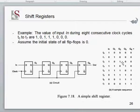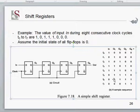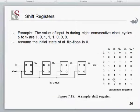And then this whole thing is clocked through. And what you can see is every time this whole number is shifted up by one bit after every clock edge because of this whole sample and present at the output effect, that all happens synchronously. Synchronous just means at the same time. They're using the same clock. All right, so you have this effect where this shift register is just remembering 4 bits of information, and the way that we input data into the shift register is through a serial method, and the way that we output it is also serially. Serially just means on the same line at different steps of time or different stages of the process. So time segmenting it, at different times we're presenting that number or different bits of that number at the input, and then at that different times, 4 clock cycles later, it will appear at out.